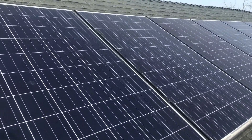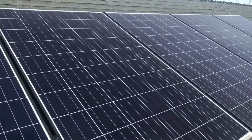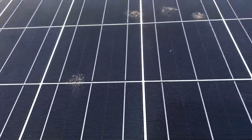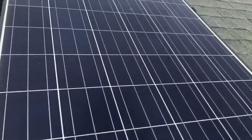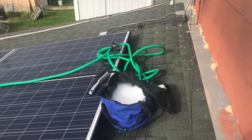You can see that these panels appear to be relatively clean because we're in the middle of winter and the rain actually helps to keep dust and debris off the panels. But what you'll notice is that we still get heavy bird droppings, which can definitely reduce the output of the system. Regular cleaning is important for the overall longevity of the system — if the solar panels aren't kept clean, the glass will actually begin to calcify from the minerals in the water.